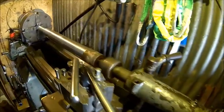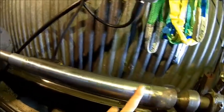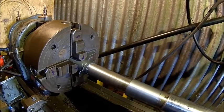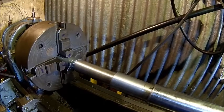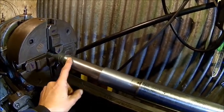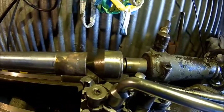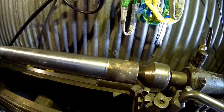We turned it around and dialed it in — it's about 100th of a millimeter here and just over 100th, but the surface is not very nice. It runs through though, I'm happy with that. We taped it up a little bit just to make sure we're not going to leave marks on there. It's not super critical because we're not going to clamp anything on that — the bearing sits here and the taper locks it here. I'll put an old tool in first because it's really rusty, so we'll scrub that off and then try the WNMG and see how it performs.